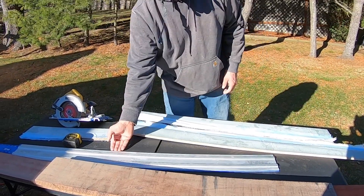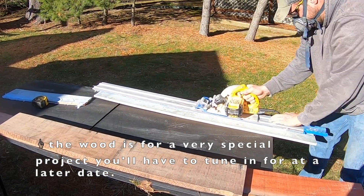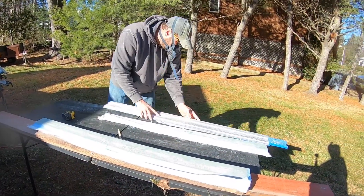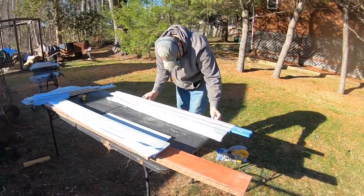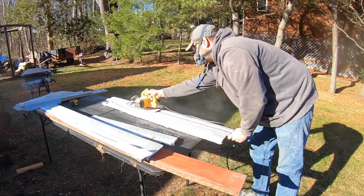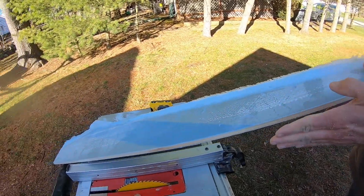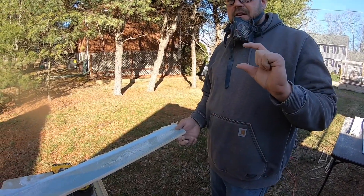I'll try to do this without cutting through the table. So what I just did was I cleaned up one edge on all of these — these are just scrap pieces from our hull panels. I cleaned up one edge where it's nice and straight, and we're going to run strips off of this. That will allow us to put a doubler all the way around the edge of the swim platform, making a double thickness.